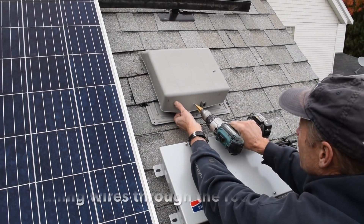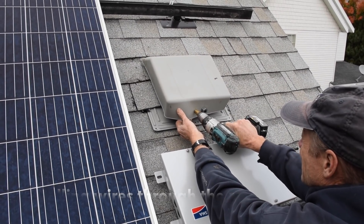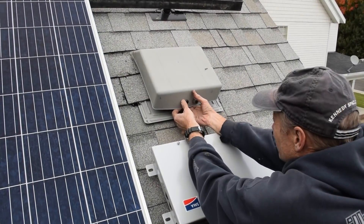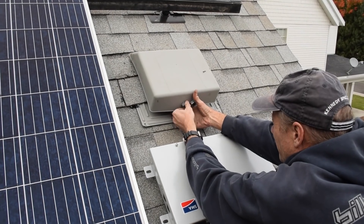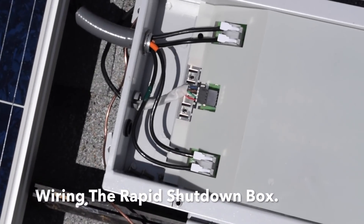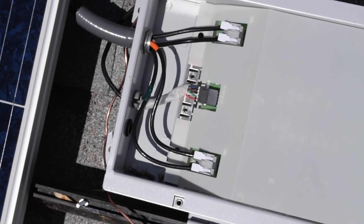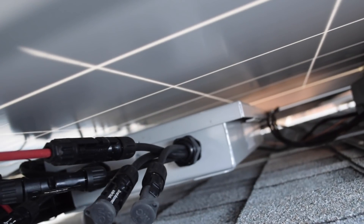We used a regular roof vent to bring the wires through the roof deck. We set the vent just like the rack flashings, then drilled holes in the roof under it and pushed the wires through from underneath. We used a cord grip connector as a cord protector and to help seal the opening. The wires running to the inverter from the rapid shutdown box were pulled into the box and attached per the manufacturer's instructions. After the last panel was set, we plugged the positive and negative wires from the panels into the plugs on the rapid shutdown box.